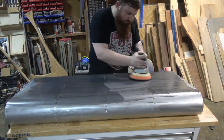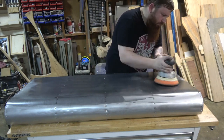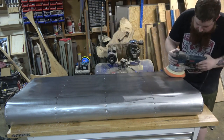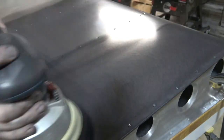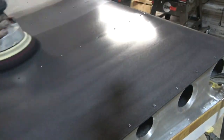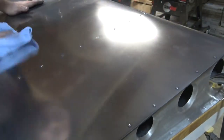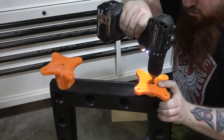This is really messy work. I usually start out using 600 grit but only had 400 so I had to settle for that. I start buffing with rubbing compound to remove the heavy scratches before switching over to an aluminum polish. It's important to use a powerful buffer that can really turn some high RPMs if you want a really shiny surface. For now I'm just doing the bottom and will do the rest once everything is assembled.